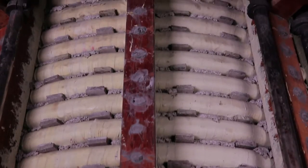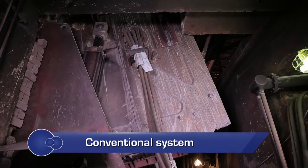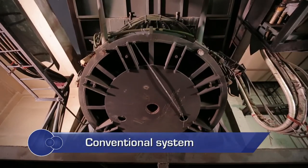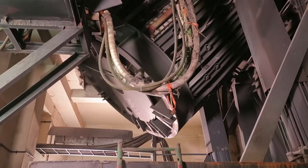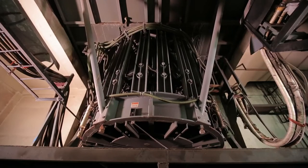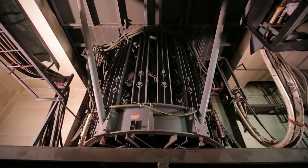The coil cradle assembly is held into place by two aluminium covers. The coil and the top and bottom refractory elements are connected with each other through SS tie rods, such that all these tie rods remain electrically insulated from each other.